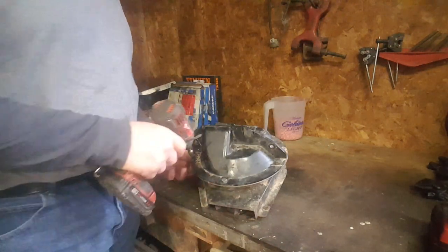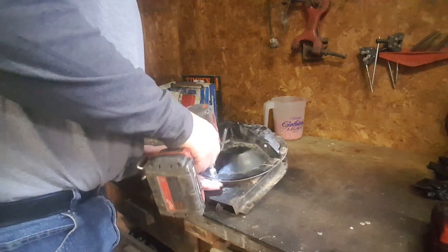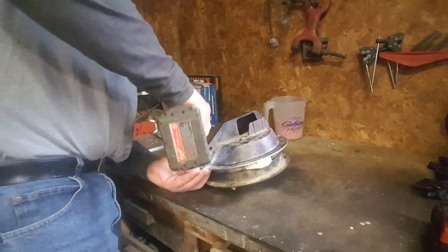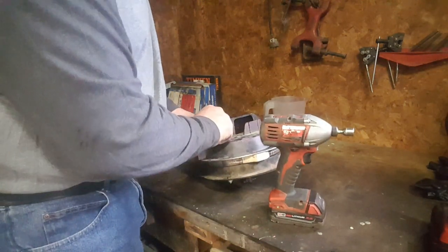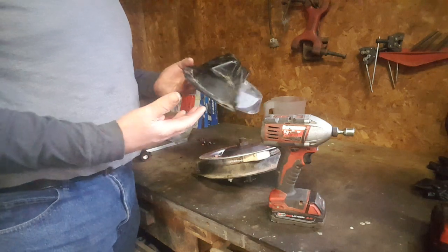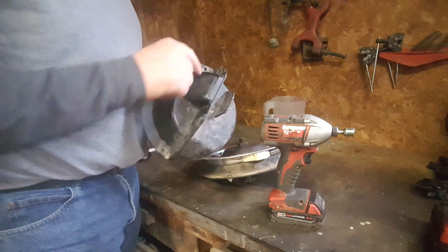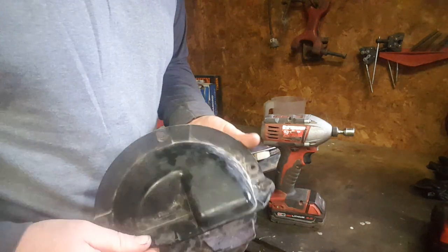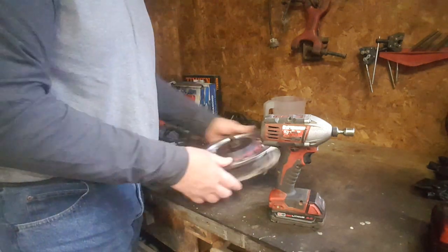These are super, super simple - fast and easy once you understand them. You'll wonder why you were spending money at your dealership. There's our seed cover. When you put it back together or remount it to the hopper, you do not have to reef down on those nuts and bolts. This one's already cracking out because it's been reefed down on too much. Just get them snug - we don't have to get carried away.